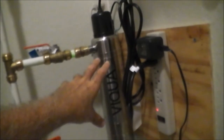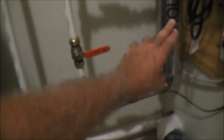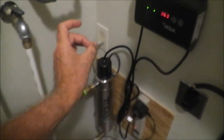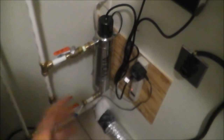Once a year I have to change the light bulb. To do that, I'd turn the top and bottom valves off and open the bypass, so water skips the purifier and goes straight into the house — that lets me work on it without shutting off water to the whole house. The bulbs last a year and are long like a fluorescent tube — they fit inside a quartz tube. After a year, that quartz tube gets calcium scale and mineral buildup, which reduces how well the light shines through, making it less effective.